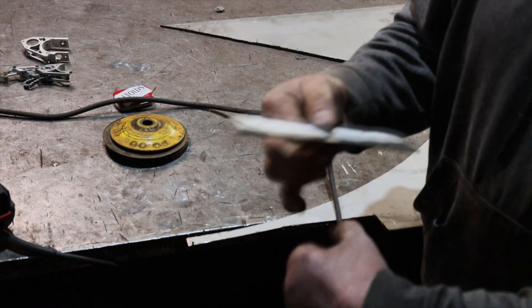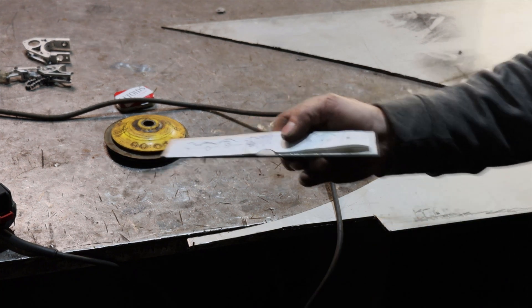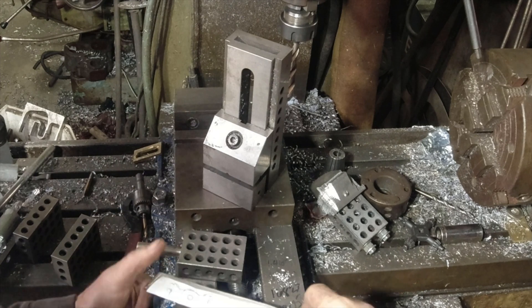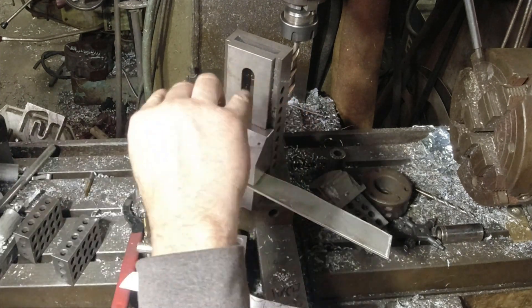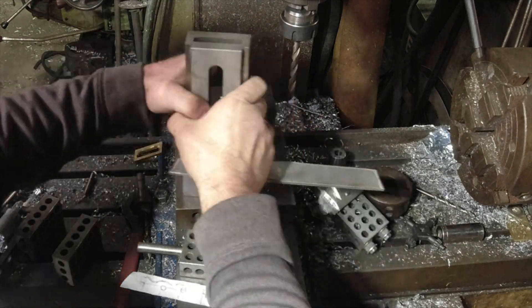Still need to cut this little notch out, and that's for right here — I'll probably do that over on the milling machine. For this setup, I'm using the 3-inch toolmaker vices from the surface grinder. For a piece like this where there's nothing parallel on the profile, it's best to just turn everything sideways and drive it by the thickness in order to get the cut.